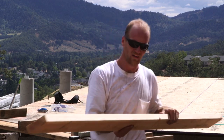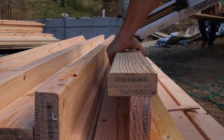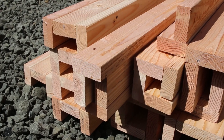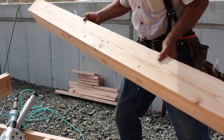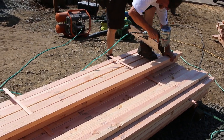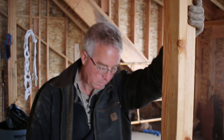There is another older way to make a corner. I had Daniel prefabbing a lot of these at the beginning of the framing process — building a certain number of California corners and wall channels. The beauty of prefabbing wall channels or California corners is they're automatically right or left, they show up everywhere, and you're always glad to have one close to hand. When nailing them together, they need to be flush on the face all the way from top to bottom, and the ends need to be exactly flush — if you're sloppy in either of those, they're pretty much worthless.